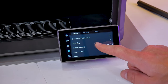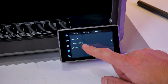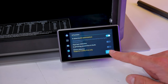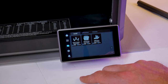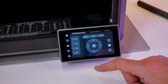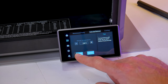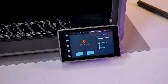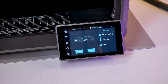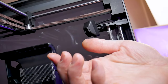It's a good idea to get familiar with the user interface on the front touchscreen. In the system settings you can find your firmware version. In the camera section you can enable time-lapse photography, and there's an AI function menu where you can enable AI print failure detection using the camera. There's also a motion advanced setting which uses the LiDAR sensor. The K1 Max has its own internal memory preloaded with some test prints, and in the control section you can set nozzle temperature, print bed temperature, and load filament. After preheating to 230°C it will automatically start extruding. Don't forget to remove the lens cover from the camera so it doesn't look blurry.